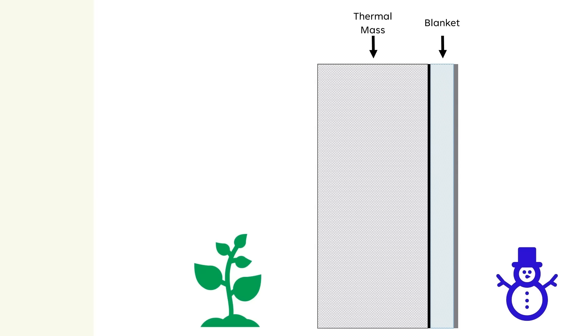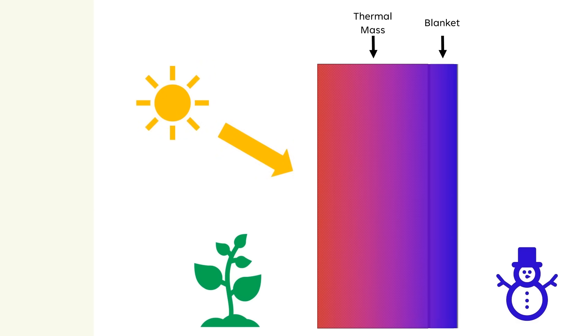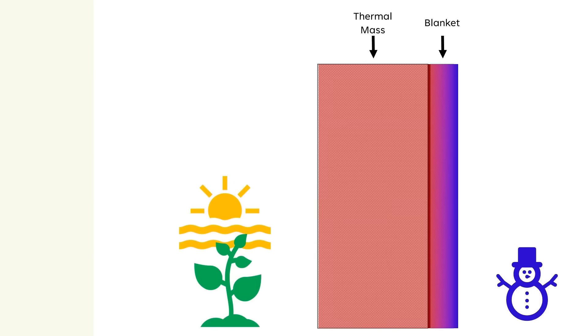The heat storage system consists of two-foot-thick portable concrete blocks that are readily available throughout the United States. On the left side of this illustration we have the inside of the tunnel, and on the right side we have the exterior. When the sun comes up, it shines on the blocks, gradually warming them up. By the time the sun sets, they've absorbed a fair amount of heat, helping to keep the high tunnel cooler during the day, and then giving that heat back up to the inside air at night to help dampen the daily fluctuation of temperatures in the structure.